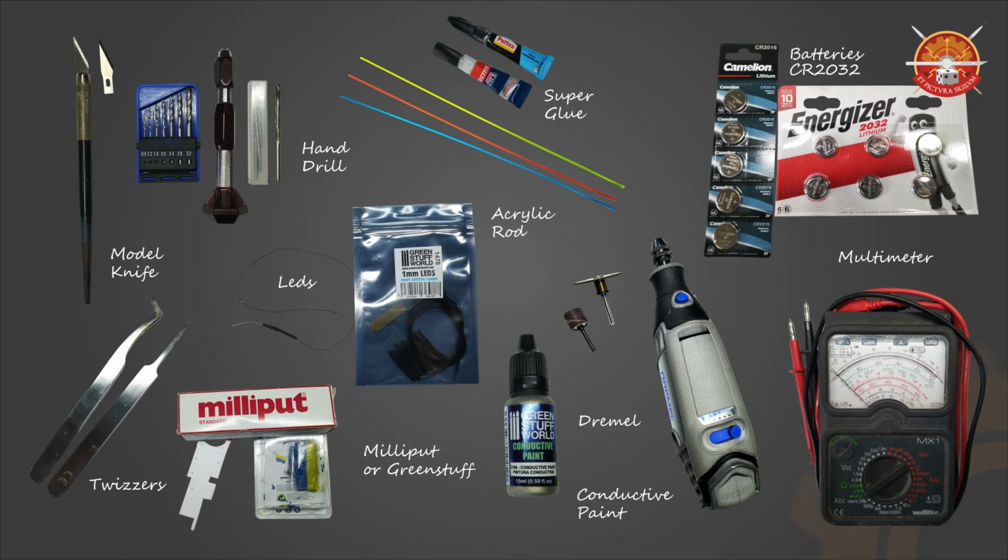You can also use CR2016 batteries, which are half the height of the first one, so you can fit two for one CR2032 and go up to 6V capacity to light up your LEDs without doing a base augmentation, so that will depend on what battery you can find. Just remember that you cannot mix batteries between size or voltage capacity, and even between brands, because you never know what they do.